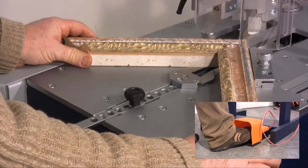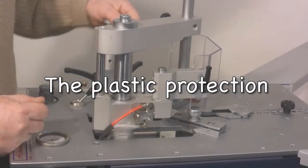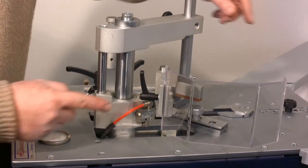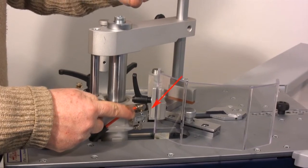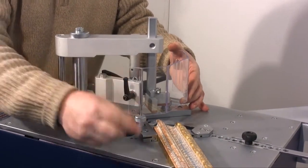You press the pedal to make the horizontal presser work. The presser remains blocked for the whole time the pedal is kept pressed. You have to release the pedal to release the presser. The transparent plastic protection has to be lowered the whole time whilst the machine is being used. If it is lifted all the machine's functions become inactivated. This is the valve that inactivates all the processes when the protection is lifted. The protection can be moved upwards or downwards, and its vertical position is fixed by tightening the appropriate lever.